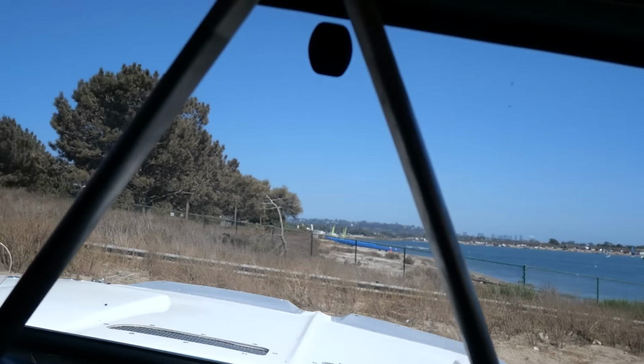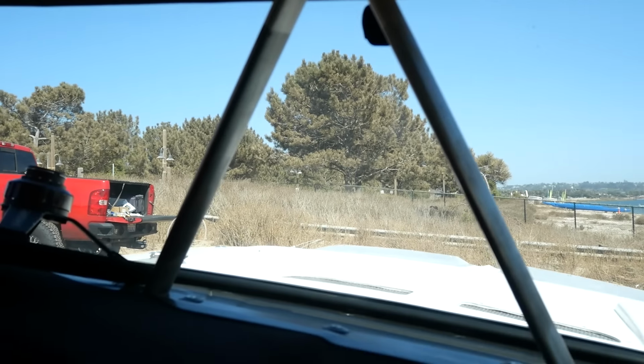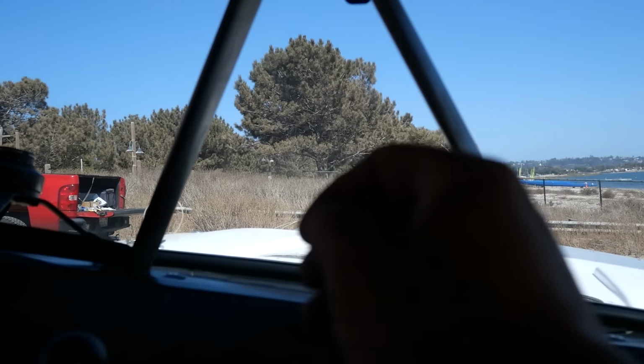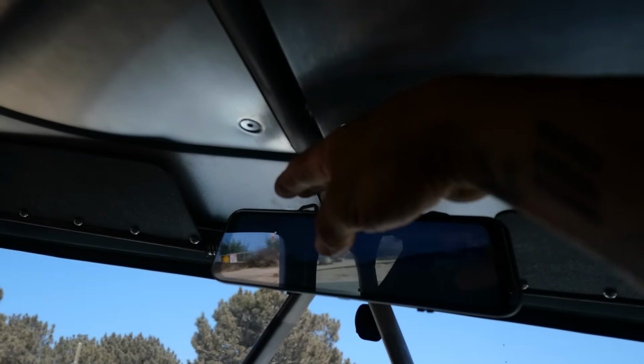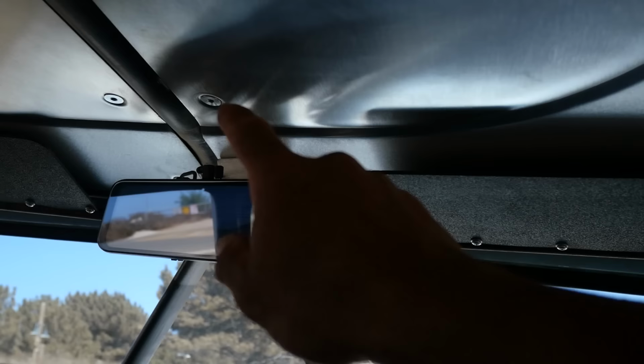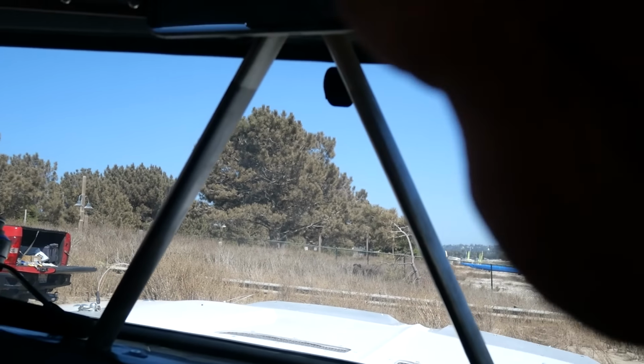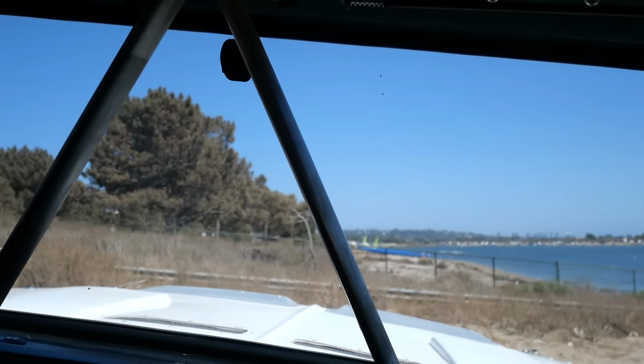Right. It's very similar if you think about, I don't know if you've ever done that where you take an empty soda can and you stand on it and it's strong and you can put your whole weight on it. And then if you flick it, you do some kind of a lateral load into the can, then it'll crunch, and it's the same thing. Like these kind of areas, you can add lateral support because they're not having infringement where something's going to load it from the side, right, and crunch it. Really, the only thing that's wanting to come down is pressure points from the corners, and pressure point from that top tube, and it's pushing directly on that. Yeah. So all it needs is a little strut to hold it up. So it's a good detail.